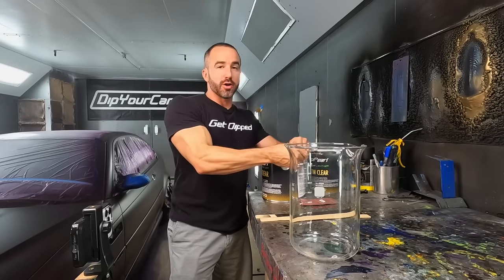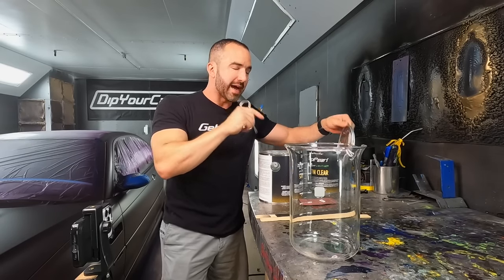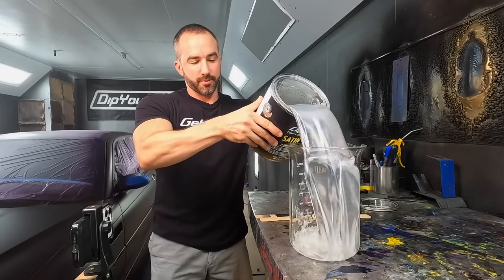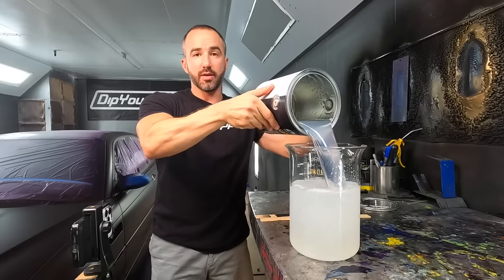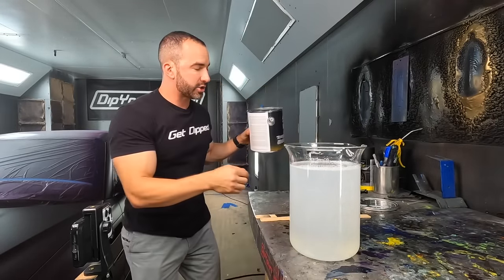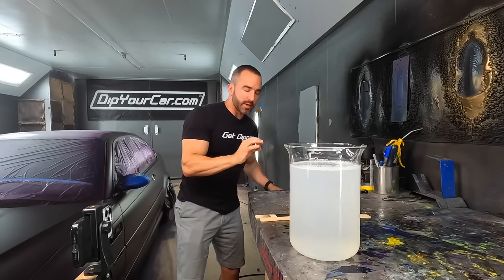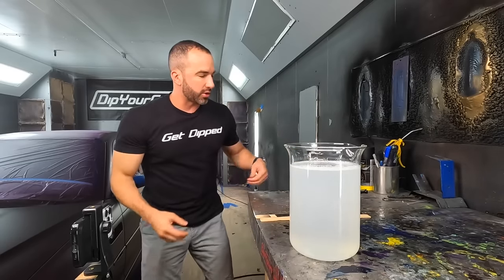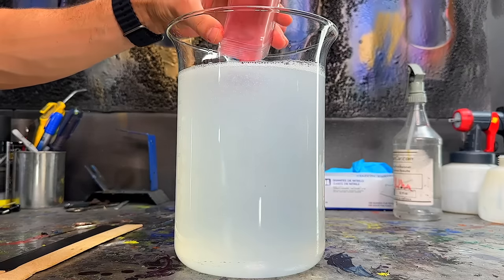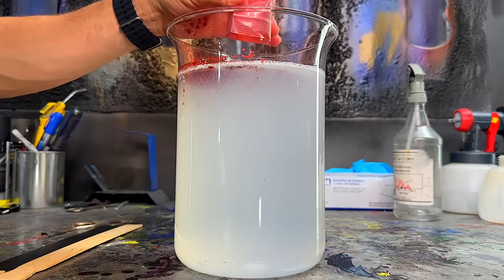Now, Gabe and I were talking about what color to use to properly show this dynamite satin sheen. We came up with what, Gabe? Why don't you tell him? Came up with some real red. Real red, same pigment load, 12.5 grams per gallon, over a black cherry base. I think this is gonna look rich. It's gonna be just saturated enough, and it's gonna show the sheen beautifully. So here's 25 grams of real red. Like always, we're gonna cut this with another gallon of next gen satin.